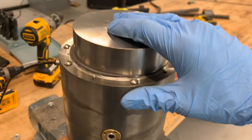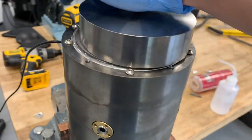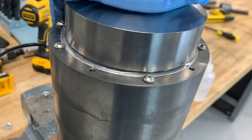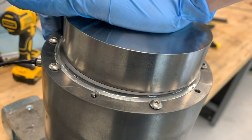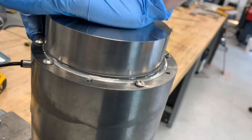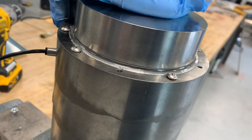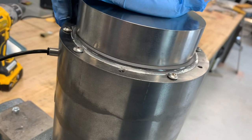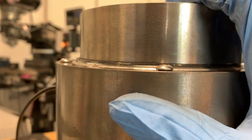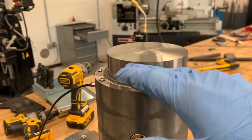But to demonstrate why you need to tune — so this one's not, just the raw graphite — if I start to preload this... that buzzing, put a little more weight. So you get this air hammer effect where there's too much flow through the gap, and basically the thing is just oscillating up and down.